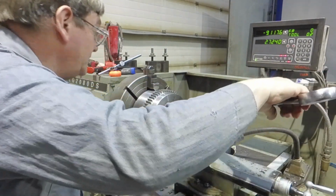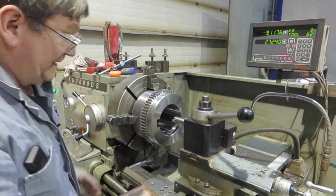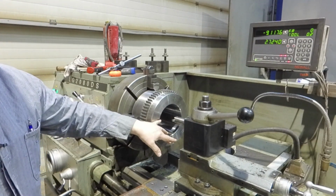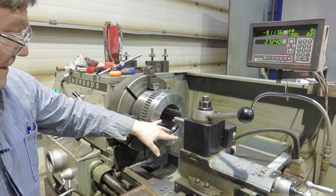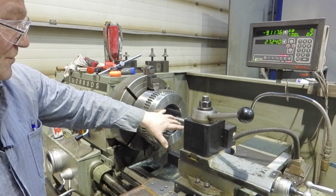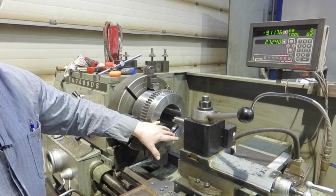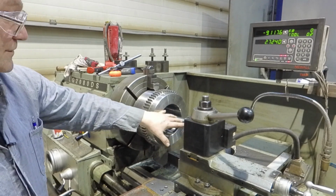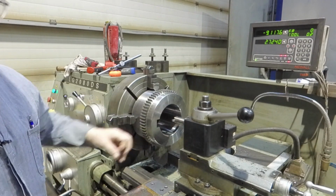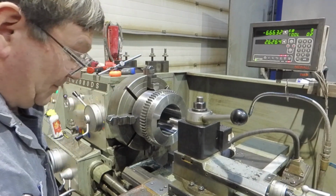Now, on this one again, we're trying to be very precise. If you're off center, your numbers don't come out as good. If you're on center, then you're at the diameter. If you're above or below center, you're at a point, and thousandths off of this is more at the diameter because you're coming at an angle. A thousandth movement in here will cut more. So the closer you are to center, the more repeatably accurate you are.